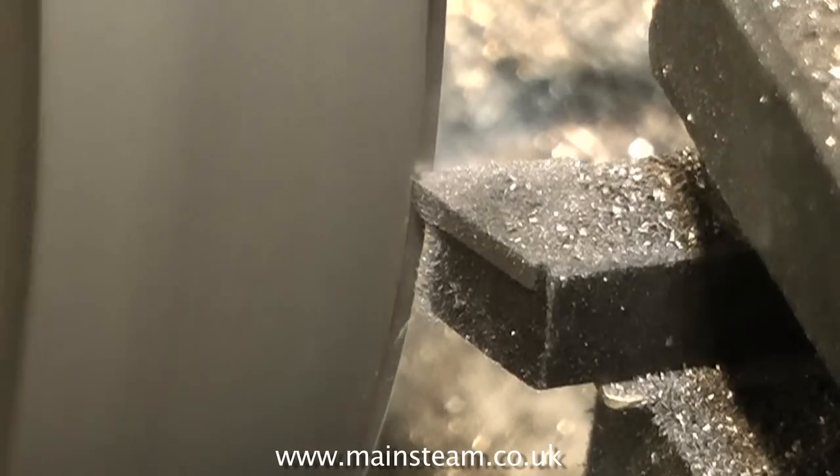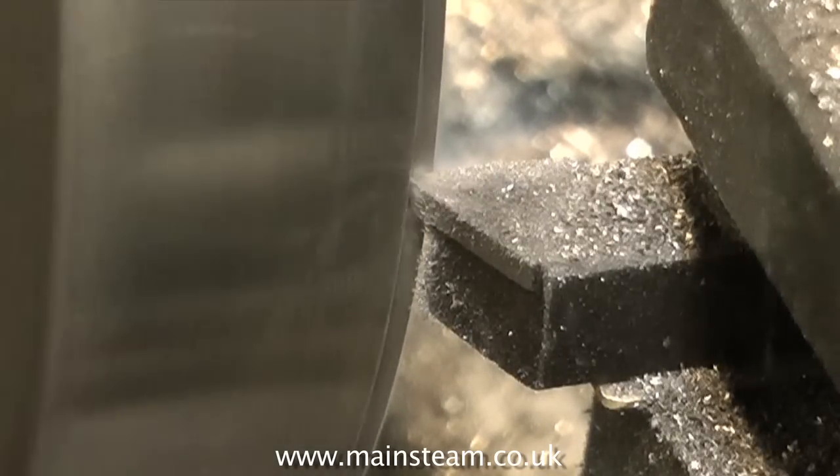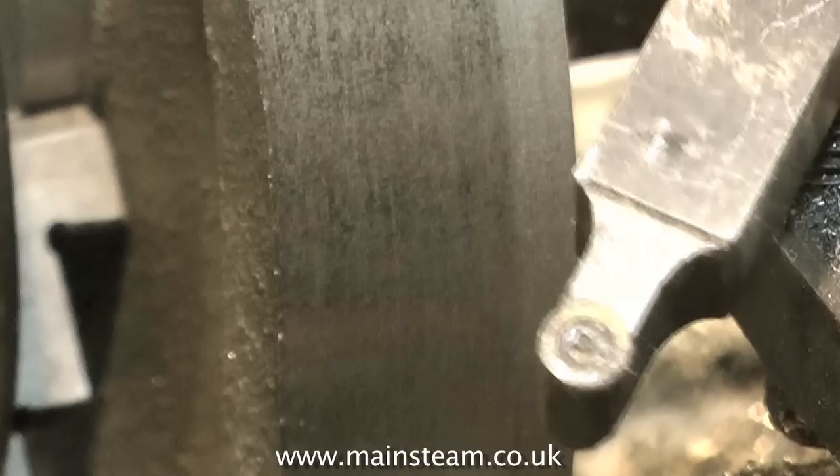If I was using the larger of my two lathes to machine this flywheel, I would normally use this round button tool. The good thing about this lathe tool, particularly for machining cast iron, is when the tip gets blunt you can rotate it several times and get maximum life out of the tip. But unfortunately I can't use this on this flywheel, as it's too large a diameter for such a small lathe. So I'm just using a knife tool mounted transversely, which works fine.